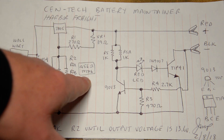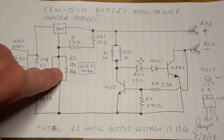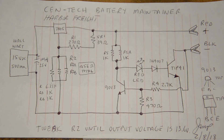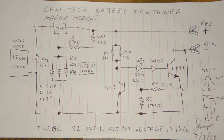The values I came up with were roughly 446 ohms for a group of resistors in parallel with two resistors in series, which gave me 13.6 volts output. You'll have to tweak those resistance ratios to get your 13.6 volts.